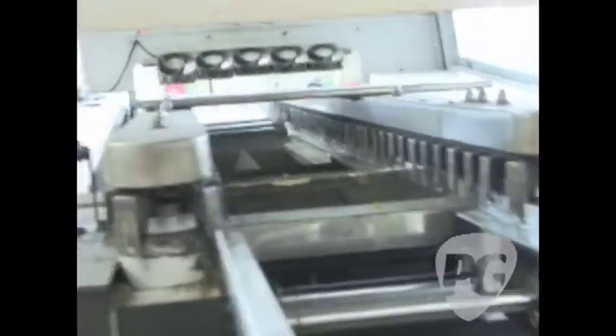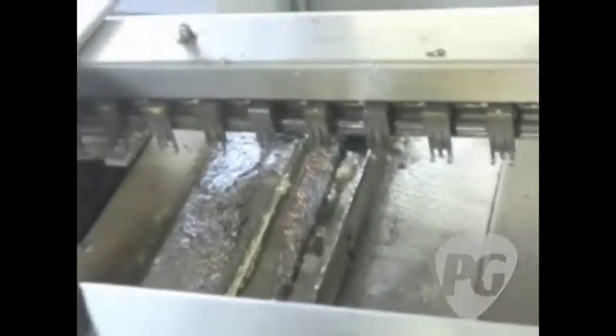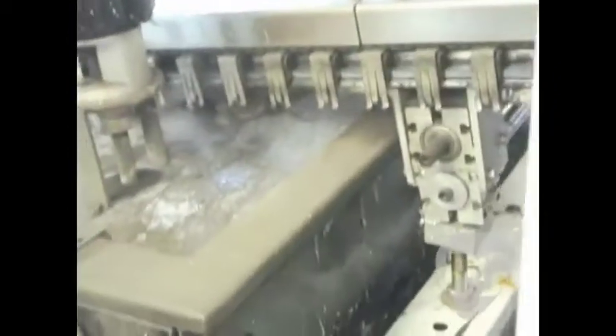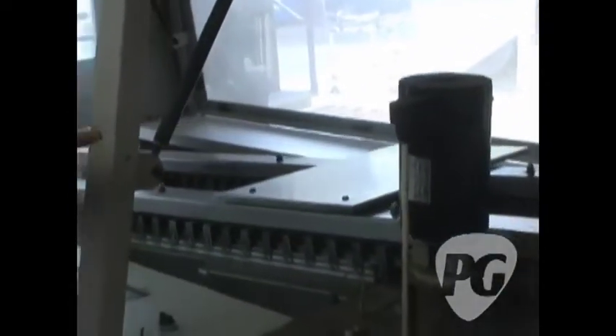Let's go take a look at the wave solder machine right now. There's the pool of molten solder. As pointed out, it's a very straightforward process — not rocket science. This is what people have been doing for years with circuit board manufacturing. There's a trough in the middle, and when a circuit board passes up the conveyor, there's a preheater that heats the circuit board up before it actually hits the molten solder. Then that trough starts circulating to create the solder bath.